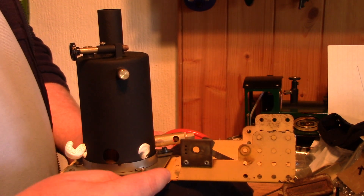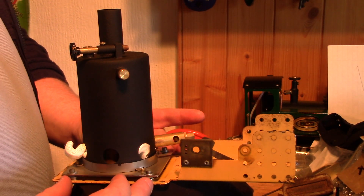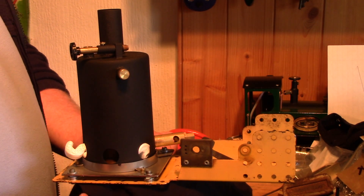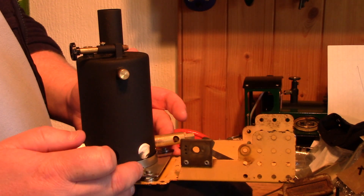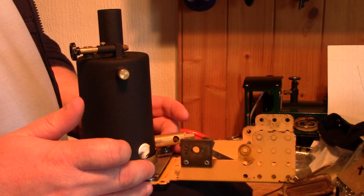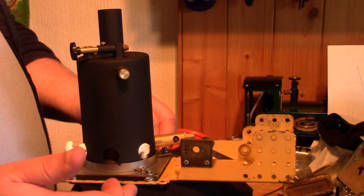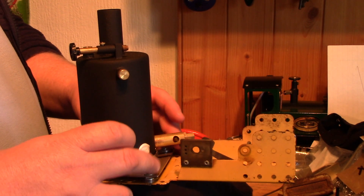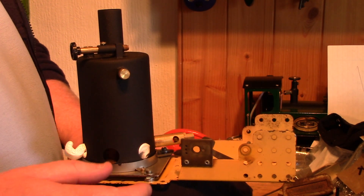There's my rather poor first cut, right on the slant really — the other side is a lot better. Initially the base overhangs a little bit, about 3mm each side, so I cut them down just for practicality. The original holes were too small and almost in line for Meccano but not quite, so just opening them up wouldn't have been in line — to about 4mm, whereas 5/32 is Meccano axle size. The original holes weren't far enough apart so I could drill into fresh metal.